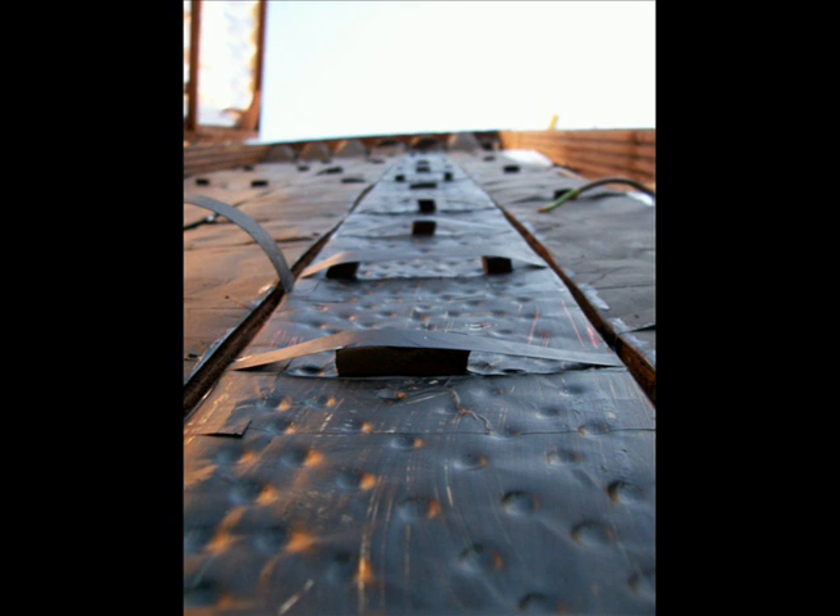What you can see here is one of the solar can assemblies. The strips across the top are pressing the top surface down so it comes into contact with the water flowing underneath. The dimples you can see have been quite a breakthrough — they stop any backflow from occurring, so you can increase the flow rate of the water. Although this doesn't look a particularly elegant way of doing it, it is certainly one of the cheapest ways I've found. I will be trying some other methods a bit later on.